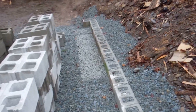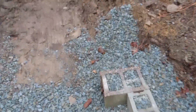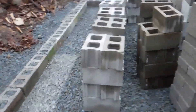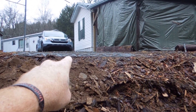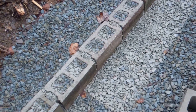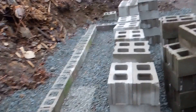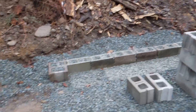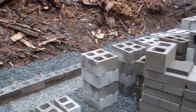I really didn't want to have to mix up all the concrete to have an actual footer, so I thought once I put this wall on top of it — I've got all this block here to build the wall with — I have some Dura wire, which are 10-foot lengths and 8 inches wide, and they lay right on top of these blocks. I'll put them between each course; I think that will firm it up well enough for a greenhouse, for that back wall, which will double as a thermal wall — or at least that's what I'm hoping will happen.